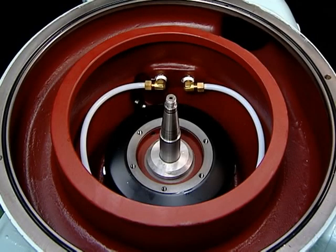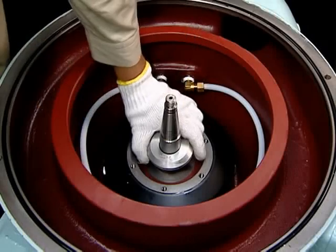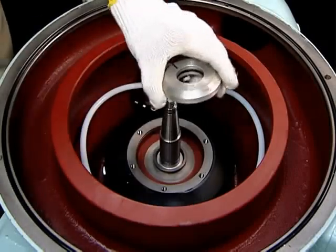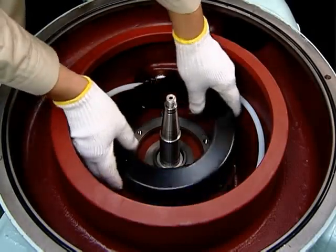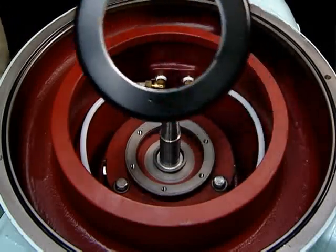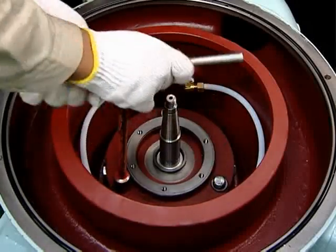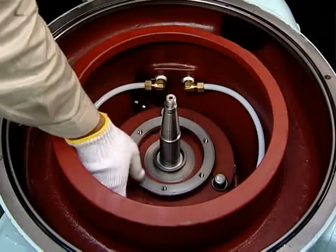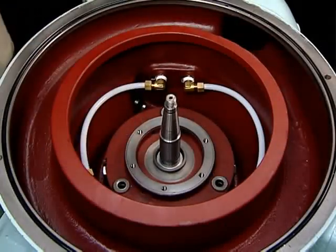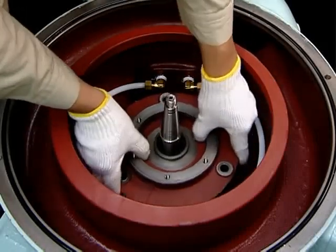This is the procedure for removing the vertical shaft from the self-jector. Remove upper bearing cap 1. Remove the mist cover. Using a T-wrench, loosen and remove the 3 bolts that fasten the upper bearing cover. Remove in order the upper bearing cover, upper bearing cap 2, panel springs, spacers.